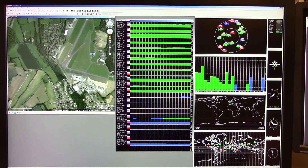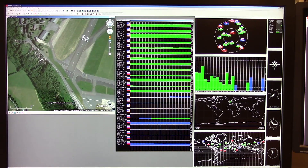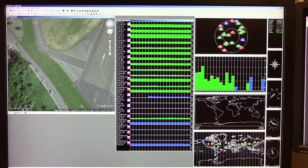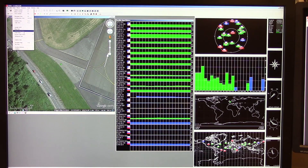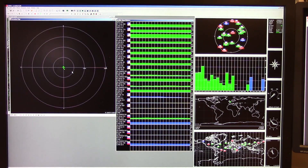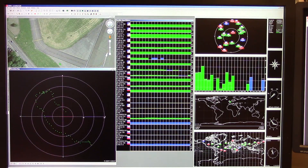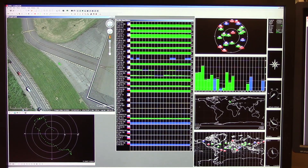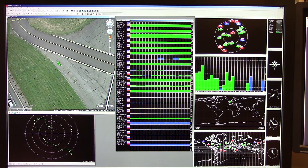On this Google Earth view — and I do not live at the end of a runway, I've offset the coordinates a bit — you can see we're getting very good positional stability there. It gives us a deviation view as well, and if I zoom in we're within two meters, though we're slowly tracking our position around a bit — not quite warmed up yet I don't think. We can see the theoretical movement on our Google map as we wander slightly around the runway. So that all works as advertised — receives both satellite networks at once.